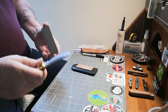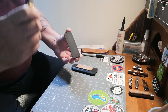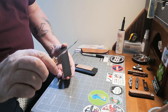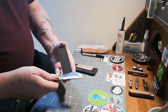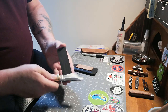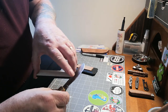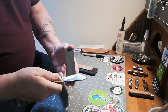There's no rush to get this sharp. This is in real time — I love doing sharpening in real time so you see exactly how long it takes. Just follow the blade round. I give three swipes and then I turn it over and have a look at where I am. I've hit right down at my apex but I've hardly come up the blade at all, so I'm going to drop it down a bit lower. You can see I'm now hitting right down to the apex and coming up a little bit on the blade.